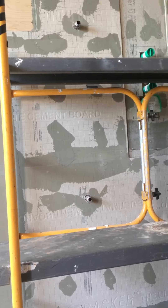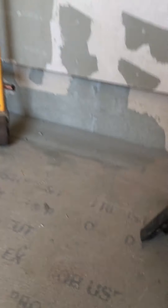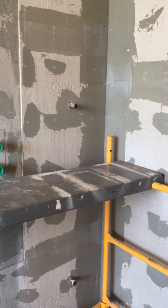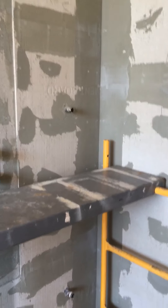If we could share anything from doing this type of work, it's important to do your corners — mesh your corners with thinset before you do the Kerdi, and then when you do the Kerdi you do that again. So it's doubly protected, because if water is going to get anywhere it's going to get into all your corners and transitions between surfaces. It's a little work but it's worth it — then you can rake your Kerdi corners and you know you've done the best you can to stop that water from getting behind there.